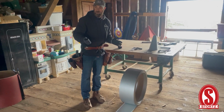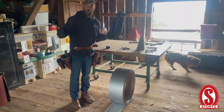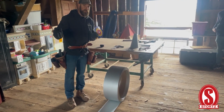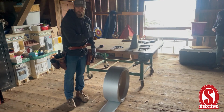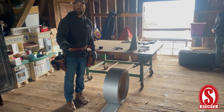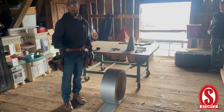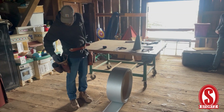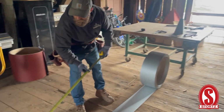Typically, what they do is they take it off a master coil. So it's a 48-inch master coil. Ideally, you would get a 24-inch coil, and there's no waste. This is the waste off of it. It's 8 inches total. They give it to you with your metal because you pay for it. But it's good for making all these parts, and that's what we're going to use to make our rake pieces and cleat.